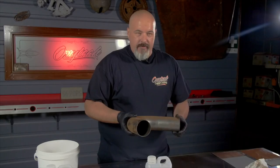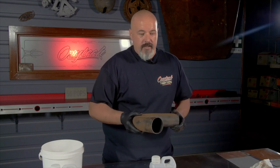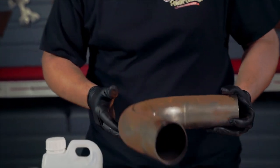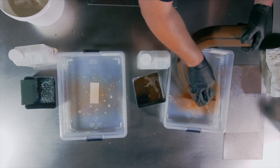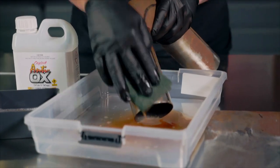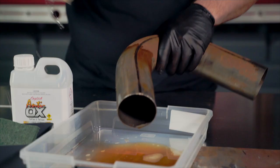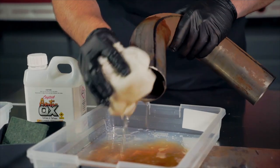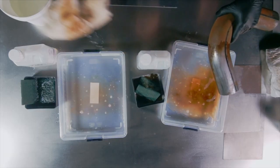This is just a bit of exhaust piping. You do not want to cut through and start welding this — you'll get contamination all through your welds. Same again, just a basic 10% mix. Clean it all up before you use it. As you can see, we're doing this in seconds here, just to show you how the process works. And you'll see it comes up clean pretty quick.